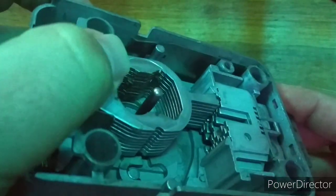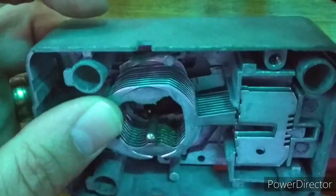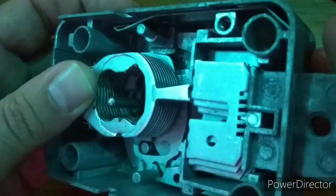Looking at the bolt, you can see a plethora of false gates, and the tips of the levers are shaped in such a way that they will want to go into those anti-picking traps.